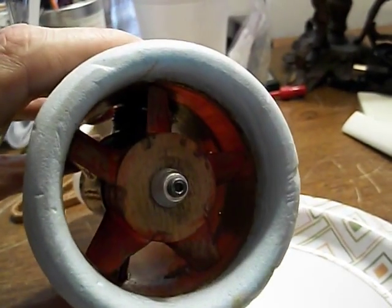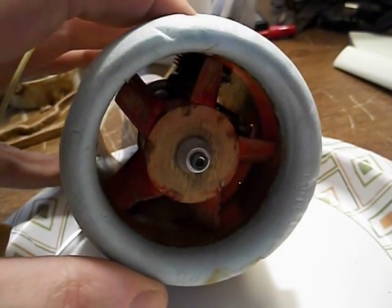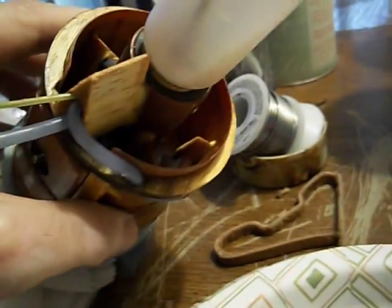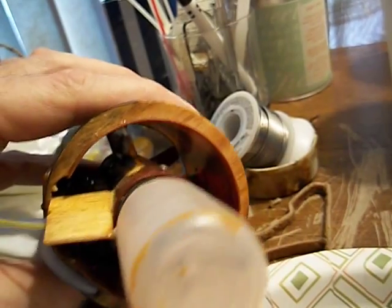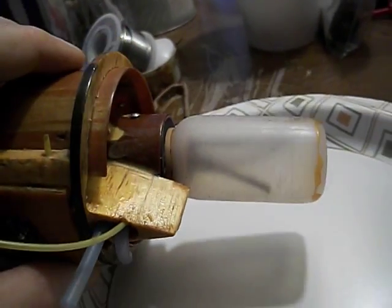What I did here was I fabricated my own rotor. That's pretty involved how I did that, but it's got twisted, airfoil-shaped fan blades. In the back I had stators — there's three stators in there; let me see if I can get better light on them. There are three stators that straighten the airflow out. This piece right here is a bearing for the fuel lines and the throttle to come up through.